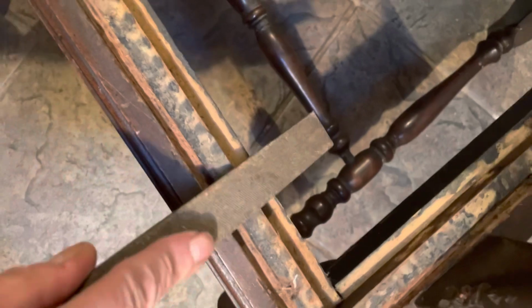Anyway, this edge though, sometimes is where a seat will break, and it's because the edge on this part of the chair frame is sharp. And so if I'm given the opportunity to put a new seat in, I would like it to last for a really, really long time. And so what I do is I take a file and I just round off that inner edge, because the seat itself, you'll see in the next part, gets pressed into this little groove and then it's taut. It's really, really tight